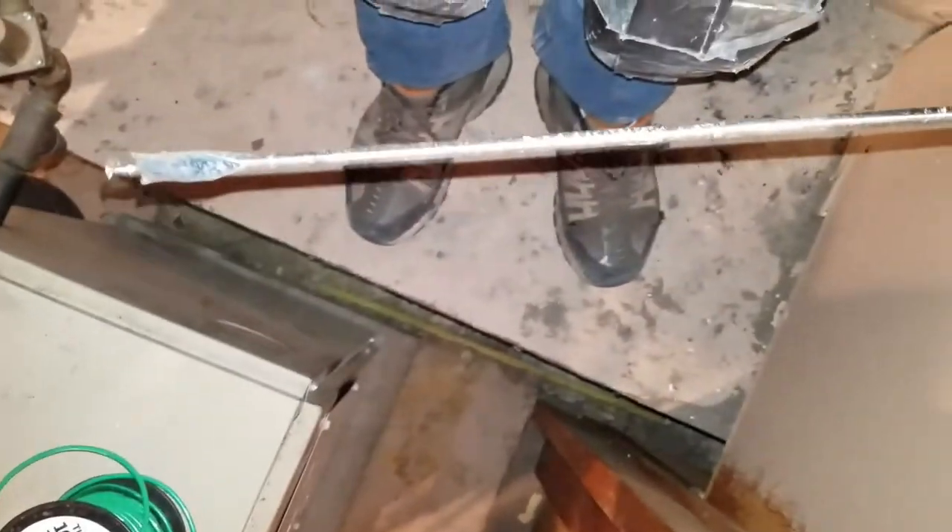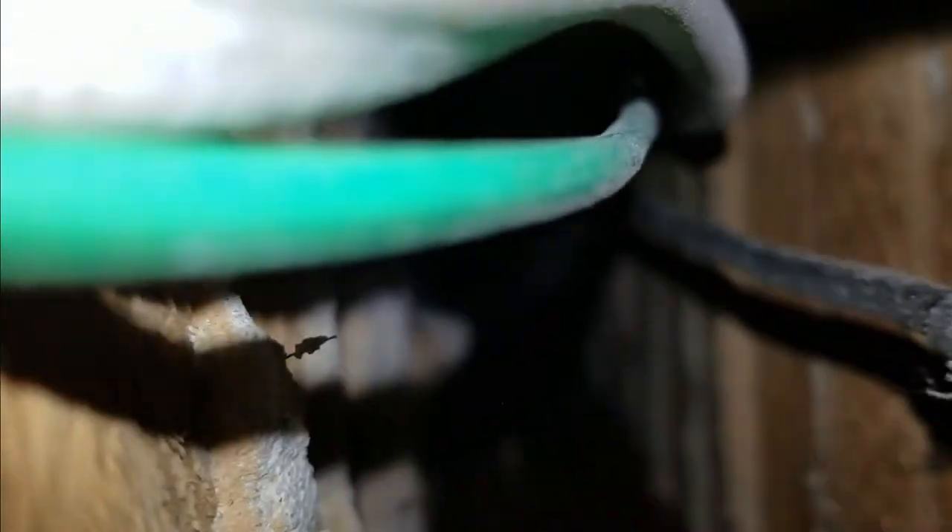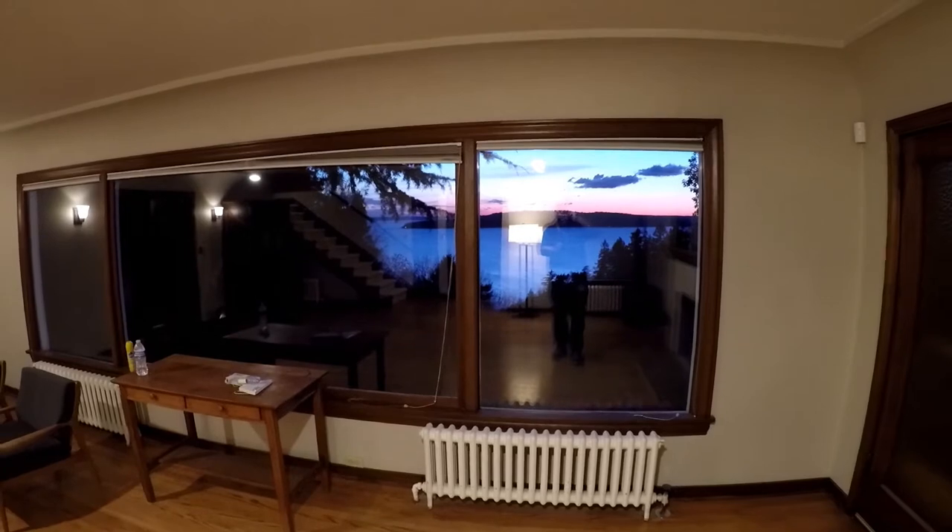I have about a 20-inch bit and that's not long enough. Now I have the wires fished upstairs from the basement - going from the fixture on the left side of the fireplace, down to the basement, across the furnace room, and then back up this side. You can see the new ground wire and power wire coming up. There are the two white wires - the two whites and the grounds going into the outlet and switch, then up to the light fixture.